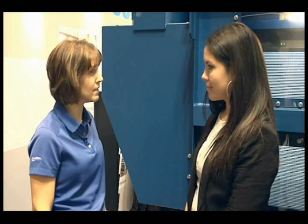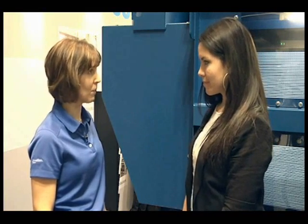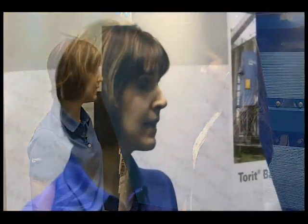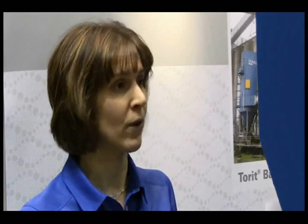Using a CPV collector will save you time and money. CPV collectors are great for tight space installations and can save you up to 50% to 70% on installation costs. Because of their size, they're great for keeping the product in the process stream, and they can eliminate long runs of ductwork. Eliminating these long runs of ductwork reduces air flow volume, reduces your horsepower requirements, and can reduce your overall operational costs.